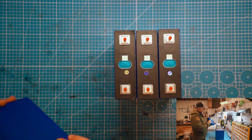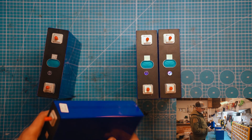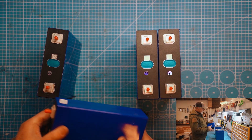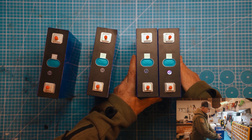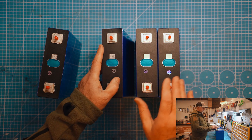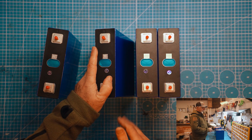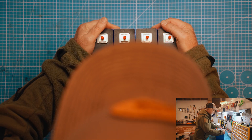Looking at a few of them, I don't see any issues. We've seen so many hundreds of cells and we're quite used to it, but these look fine. There are no bulges or anything like that to speak of — they come quite snug. This one here has a very slight bulge, but it is normal to sometimes have a slight bulge as long as they compress fairly well. So no problems there.